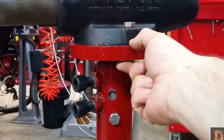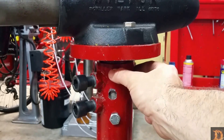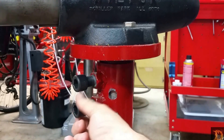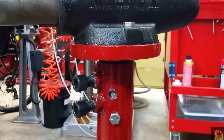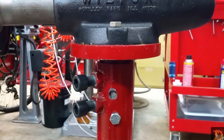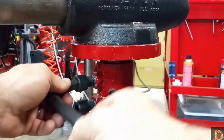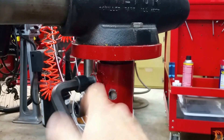The vise is mounted to a plate that's seven-eighths inch plate steel, seven inches in diameter. There is a solid two and a half inch welded to this plate, and that solid sits in this column — two and a half inch pipe. I've welded two 3/8-16 nuts, and there are two 3/8-16 socket head cap screws that allow it to swivel. You can put it in any position and then crank down on the socket head cap screws to hold your vise rigidly in that position.